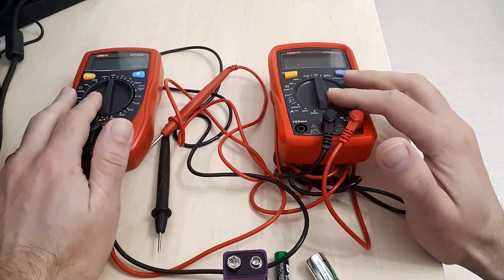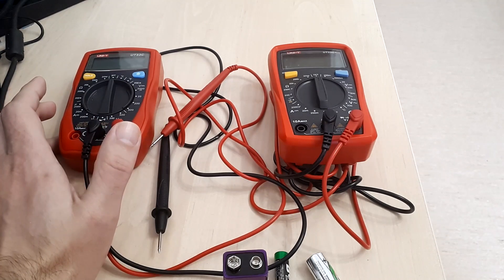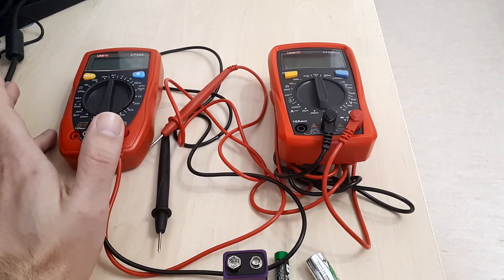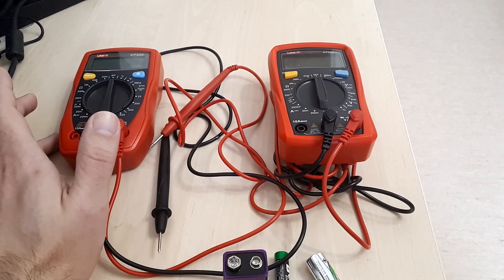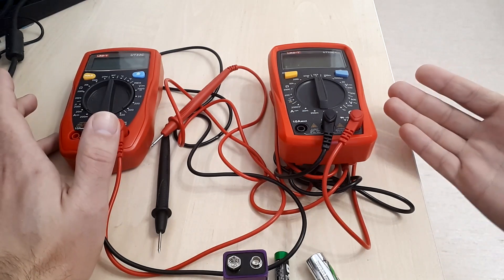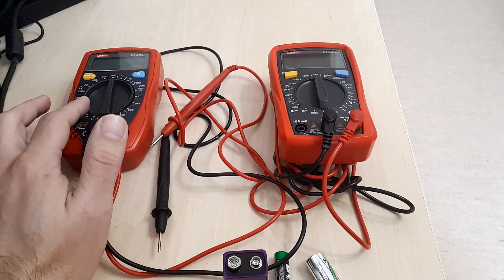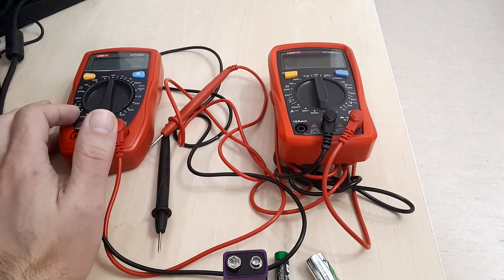First of all, you have the same rotary switch. We are not talking about an automatic ranging multimeter, so we have to get that out of the discussion. For many professionals and hobbyists, having a manual-ranging multimeter has its pros and cons. Sometimes auto-ranging is highly useful because you get to the value you are interested in much quicker. On the other side, there are situations where precision or response time is not as good as on a classical non-auto-ranging multimeter.